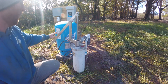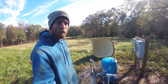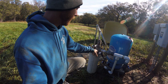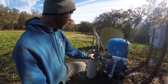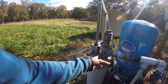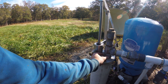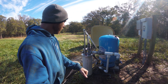It's still a nice, concise, compact job. We purchased this hand pump from Scott Hunt at Engineer 775 Practical Preppers — did a great job with everything. One thing we had to address: this is an inch-and-a-half pipe, but the hole that comes with the Simple Pump cap is inch-and-a-quarter, so we had to bore it out. We were also concerned about clearance — a two-inch pipe likely wouldn't clear the Simple Pump cylinder, but inch-and-a-half works with about a quarter-inch of clearance.